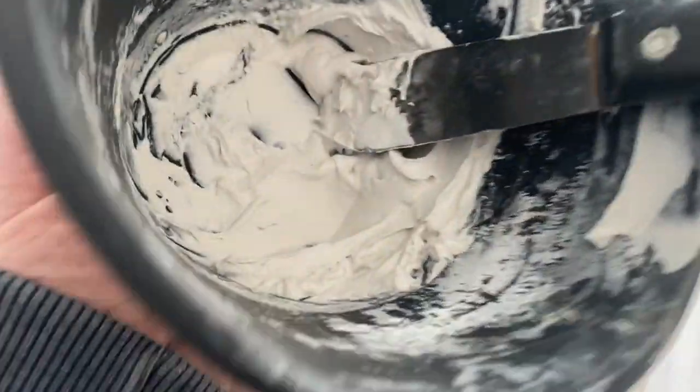The way to deal with them is first just screw them in a little bit tighter and bury it a few millimetres into the plasterboard, then use a Stanley knife edge to scrape around and get as smooth an edge as you can. Then it's simply a case of mixing up some — in my case just easy fill — and plastering or patching over and sanding down to level off, waiting for it to dry, and then paint.